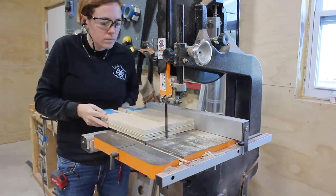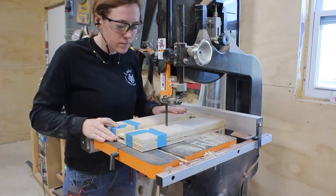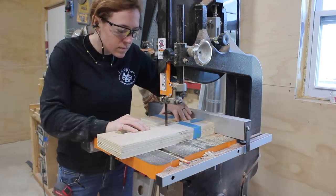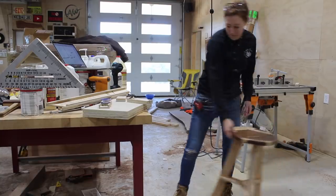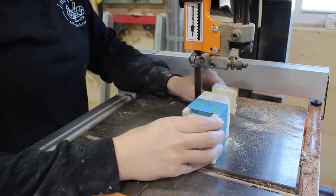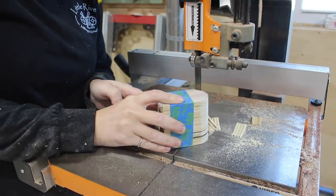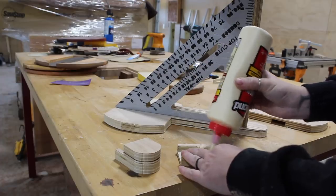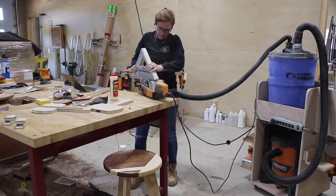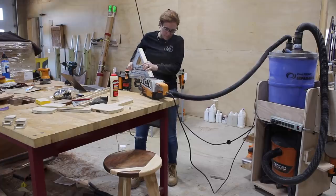I also marked off the sides so that I could remove the bulk wood and slim down the profile in order to create a kind of pedestal on the end where the seat will later go. After marking off a shape that I liked I took it to the bandsaw to cut out. While I was at the bandsaw I also taped together some small pieces and made the same rounded shape to create some reinforcement pieces for the pivot points, then glued these parts together to dry while I moved to cleaning up all the parts on the belt sander.